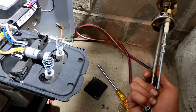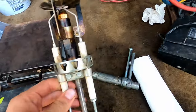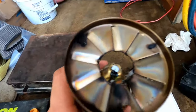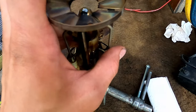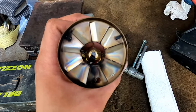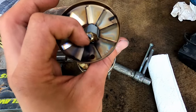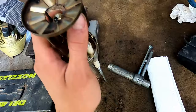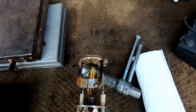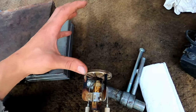I'm going to be careful not to spill oil. So I just brought our nozzle back out to the van. How this is supposed to work: you've got two electrodes and that high voltage comes out to the two points on the end. When that arcs it makes an arch jumping into the middle. This nozzle at really high pressure turns the fuel into a really fine mist — it atomizes the oil, making it into a really thin mist. Then this arcing spark ignites it. Air from that blower is forced through here in a twirling motion, so what ends up right past the nozzle and electrodes is a big ball of flame — and that's where your heat comes from.